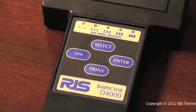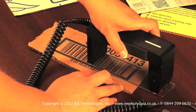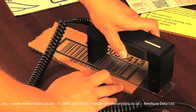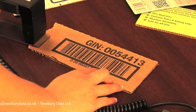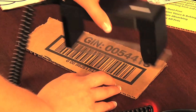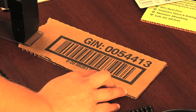To scan a barcode, start by pressing the ON button to power up the unit. Next, place the barcode to be tested on a flat surface and set the AutoOptic so that the sensor is about 2 inches before the barcode. Slide the AutoOptic across the barcode in a smooth motion — quicker is better — and continue to move the AutoOptic until the sensor is 1 or 2 inches past the barcode. Starting and ending beyond the barcode is important because the verifier needs to look at the quiet zones before and after the barcode to properly grade the code. This also helps to ensure a smooth motion while measuring the barcode.